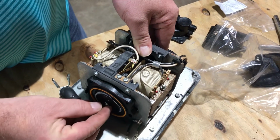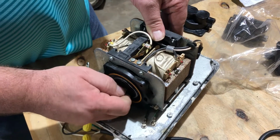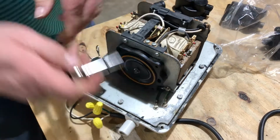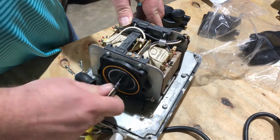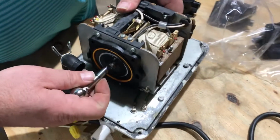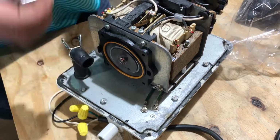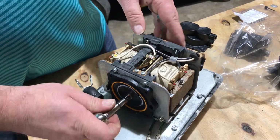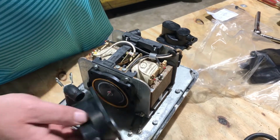get the washer on there, get the nut on there, take your 7mm socket, and these need to be fairly tight, so make sure both sides are sitting right. They're flush. So these go on pretty tight. A lot of people don't tighten them enough, and then they have some issues later. It comes loose, or it's rattling now. And well, it's rattling probably because you didn't put that screw on tight enough.